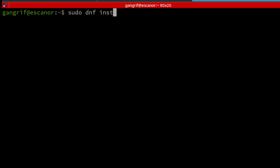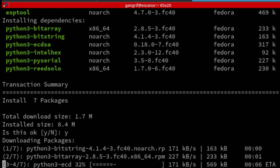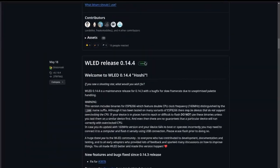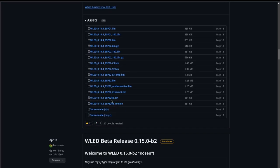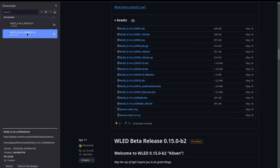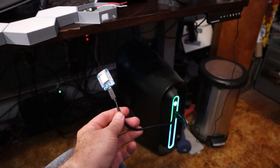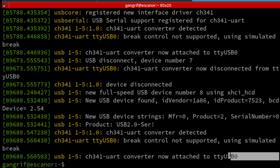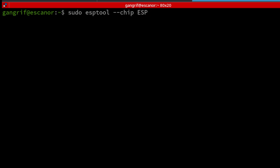I ended up using an ESP flash tool, which I'll show you in my terminal on my Fedora workstation. You'll need to download the WLED binary image — you can get that from the GitHub repo linked in the description. Download the latest release; there are release candidates and betas available. Keep note of which chip you're using — I downloaded the ESP8266 version. Once downloaded, you use esptool along with the USB port that your device is plugged into, connecting via the micro USB port on the ESP8266 board.